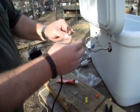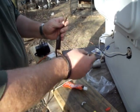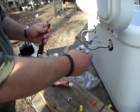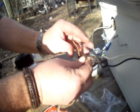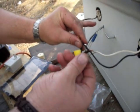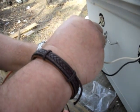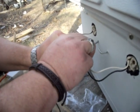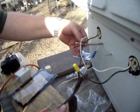We've cut our extension cord, flipped it over, and we just twist the leads together upside down like this. You're going to take your black wires, twist them together; white wires, twist them together on the back of your light bulbs — doesn't matter what side, just pick a side. Put these together, get a wire nut, and twist it on until it's good and snug.